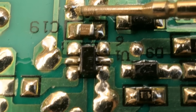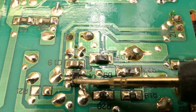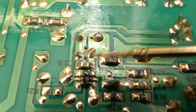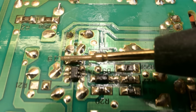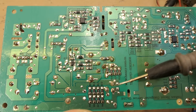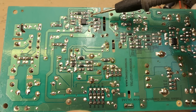Here is the negative of the small electrolytic capacitor. Here is the auxiliary power supply powering this main chip, and the startup resistors. Because it also has a standby mode, the auxiliary power supply can power the main power supply chip. I should call it the big power supply and the small power supply to prevent confusion, because each of the transformers has an auxiliary winding.